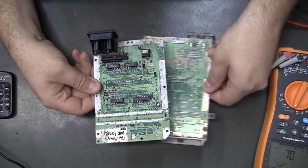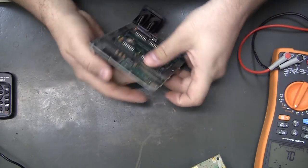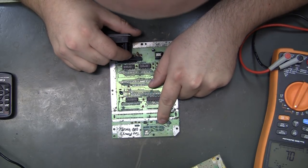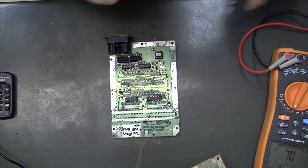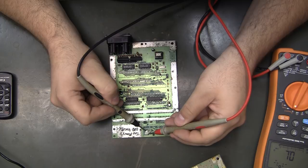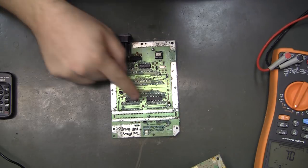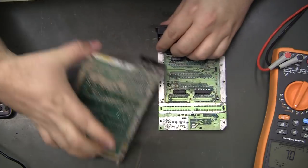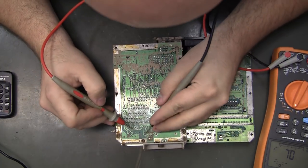Here's one of my top loader boards that just had way too many bad traces on the bottom from corrosion. You can easily see where the traces on top are that go from the inductor over to the bridge rectifier - just two short traces right there. And there to there, and there to there. Your power jack over to the inductor - like so. We know those are good, but the long one from here to here is what we seem to be having trouble getting through.